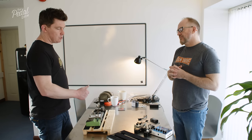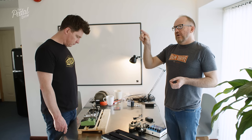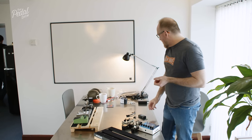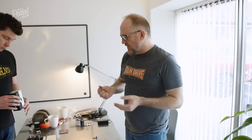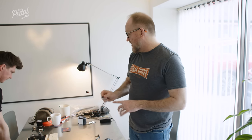And how do you know how many milliamps your pedal draws? It will say in the manual. If you have any doubt whatsoever, go and check the manual. It will say on the website, in the specification section, where it takes 9 volts, it'll say the size of the plug. For a standard 9-volt plug, it's 2.1 millimeter, and it's center negative. That means the positive part of the supply is on the outside, and the negative part is what they call negative tip or negative center. That's standard in the guitar industry, and all of these use a 2.1 center negative power supply. There's nothing different with that.